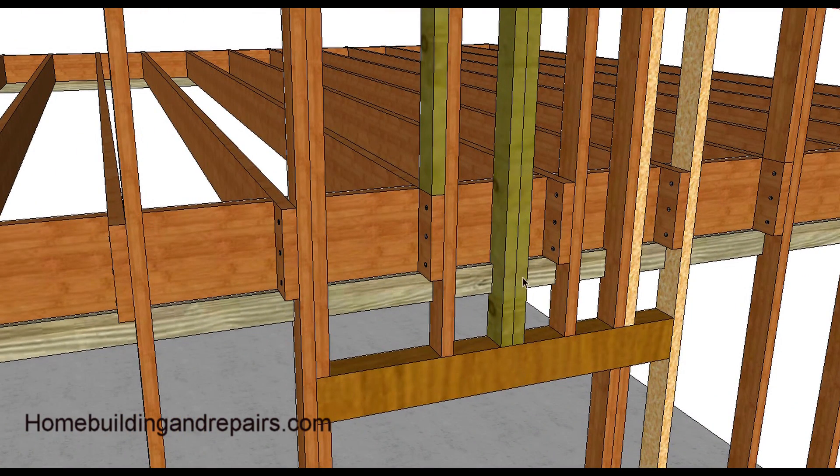Take a look at the bottom — you can see where this one goes through. Sometimes you can turn the studs: slip a stud in before you put the windowsill framing plate, drop the studs in at an angle, then turn them and get them to fit in. If not, you might need to notch these studs down and around and have them sit on top of the header. That notch can go up higher if needed, and it should give you enough support for the window.